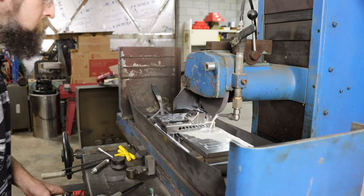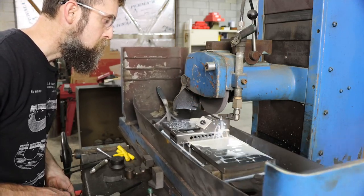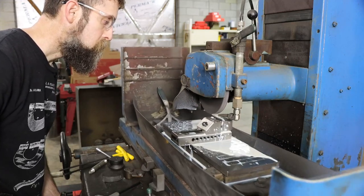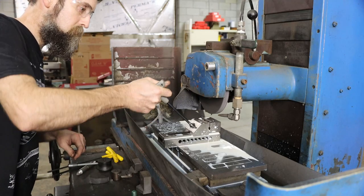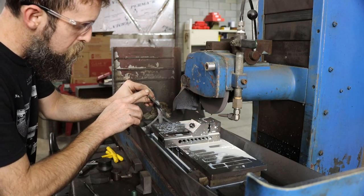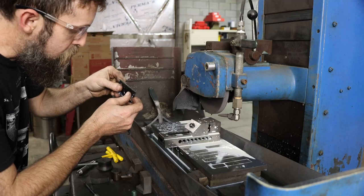So grinding the center blade is exactly the same as grinding the other two side blades. What I'm trying to avoid is grinding away too much. That way, if I did, these shears wouldn't close all the way, and then I'd end up with a blade cutter that just doesn't work. There's not a lot of excess material here to remove, so I just have to be really careful. Dust them as good as I can get them and call that good enough, or else I'll be in trouble. I don't know. It's better than it was.